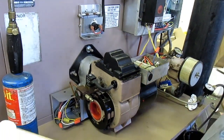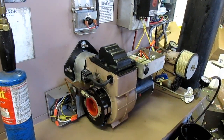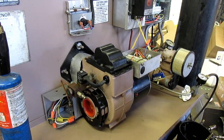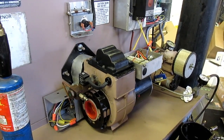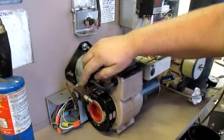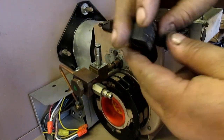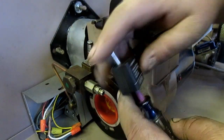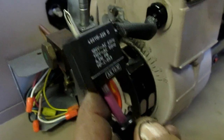Warning: on a Lenair, see our Lenair nozzle replacement video before removing the nozzle, or you may cut the O-ring. Then see if the oil fogs into the chamber. If there's still no oil flow through the block or the nozzle, check to see if the oil solenoid is getting 110 volts, or stick a screwdriver through the electromagnetic coil and see if there is a hum or frequency pulse in the oil solenoid electromagnet.